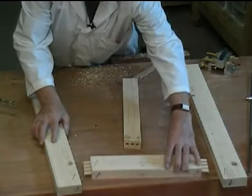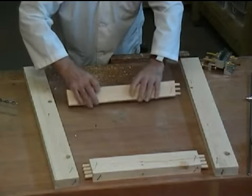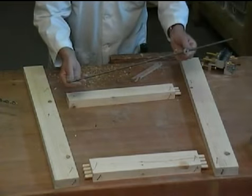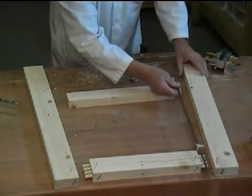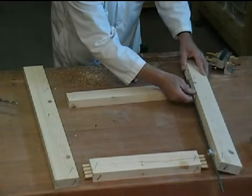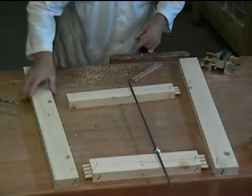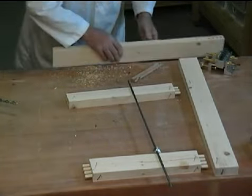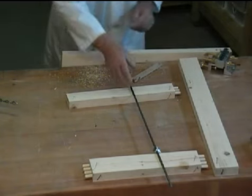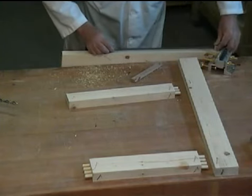Now, when you're drilling these, it is essential that the 2 rails are absolutely parallel. So we've used the extended distance gauge to achieve that purpose. For this one, we used the last hole and butted Dowelmax against the end of the rod, and we'll follow the same process on this one. Exactly the same, the last hole.